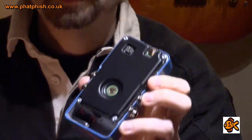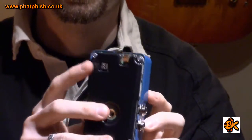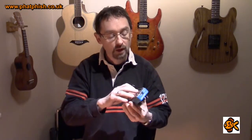In the back of the pedal we've got the battery compartment — I'm running this off a power supply so that's empty — but interestingly up here are two tiny little switches. The first one affects the way the switch behaves when you turn the pedal off. This is what's called a true bypass pedal, meaning when the pedal is switched off the signal doesn't go through the circuitry — it bypasses everything so nothing colours or degrades your signal. That top switch toggles between true bypass and buffered bypass, which is useful if you use very long cables or lots of effects in your chain. Switching to buffered can improve the signal — some people say you can't hear the difference, some say you can, but having the option is a nice touch.